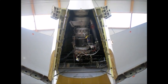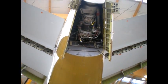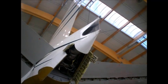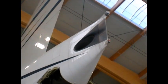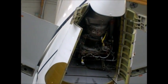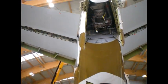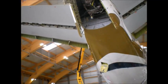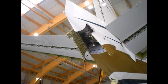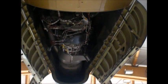This is the auxiliary power unit, called the APU. It's a little jet engine — not that small actually, it's quite big. It provides power and hydraulics when we're on the ground, and emergency hydraulics and power in the air. There's the exhaust pipe for it. It burns 700 pounds of jet fuel an hour, that's about a hundred gallons roughly. It's all the way in the tail. There it is, standing forward looking back — the APU.